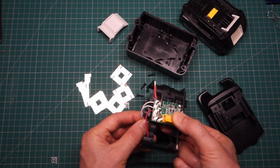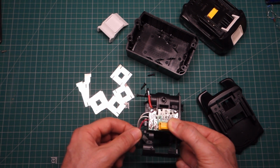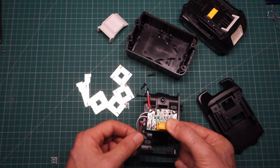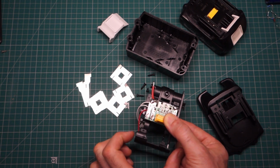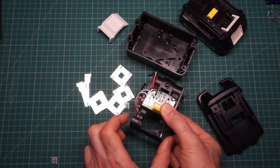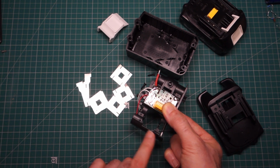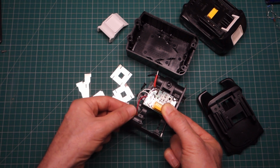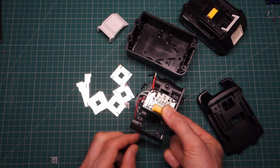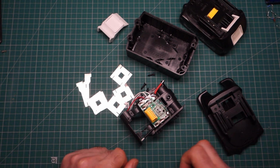So that's fairly straightforward. This line here, I believe, I'll just have to check my old pack. This line goes on the first cell, so that this printed circuit board actually runs off only 3.7 volts nominal, the one cell at one end. And that is quite often why this cell is more stressed, because it is permanently connected to the printed circuit board to keep it alive, and that causes that cell more duty. Okay,